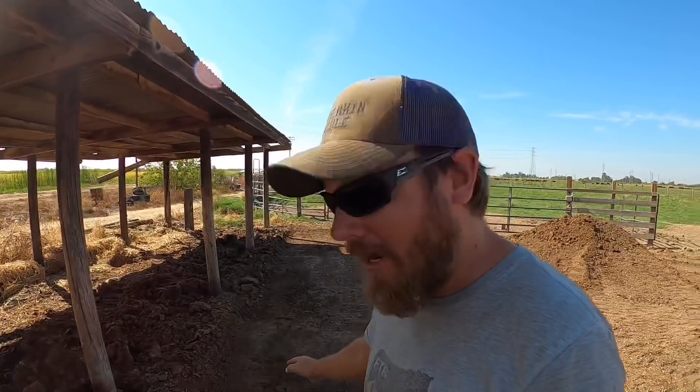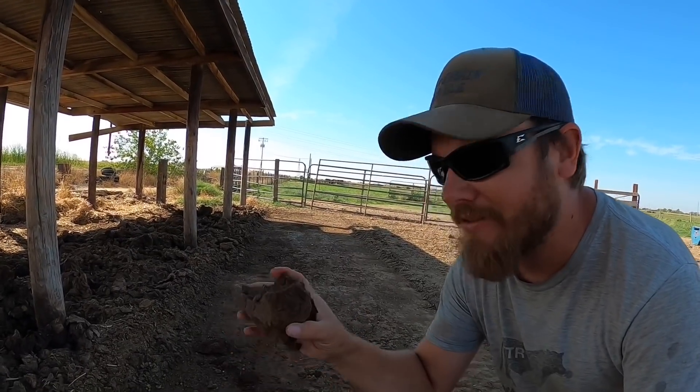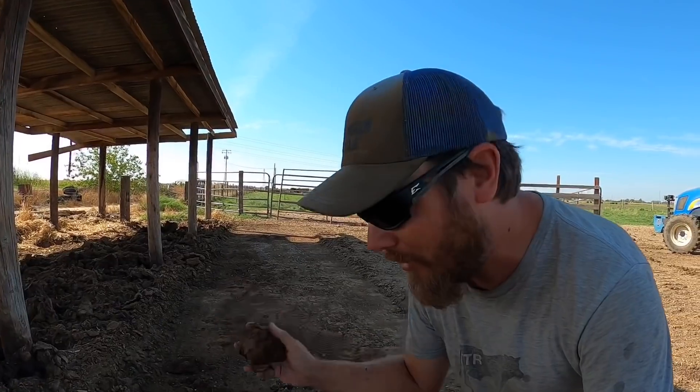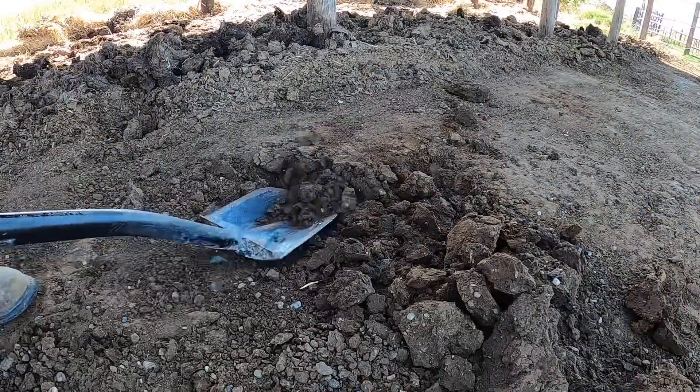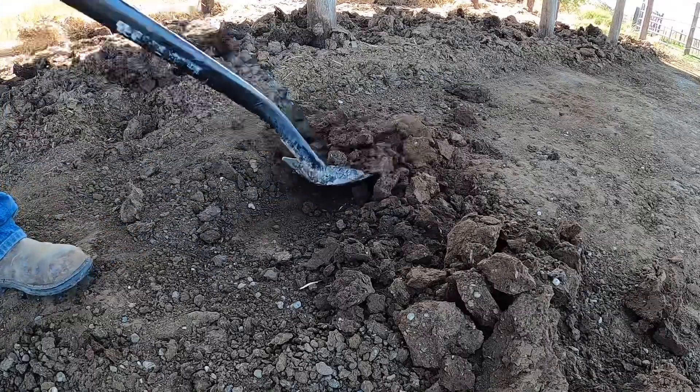In order to break up this top solid layer — you can see how platy the dirt breaks off — make no mistake, this is good composted manure, and it's going to be perfect for filling up the manure spreader and putting out on the field. But if I want to get this up, I'm either going to have to come through here with a shovel and pop it up by hand, or I can come in with the box scraper to get everything loose out of here, then come back with my little three-point chisel to break this up, and then come back again with the box scraper to get the rest of it. That's a lot of passes with the tractor, but bringing the little three-point chisel over here is going to be the way to go because it'll just take me forever to do all this by hand.